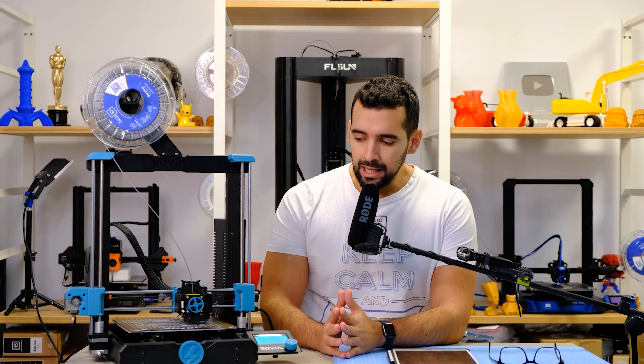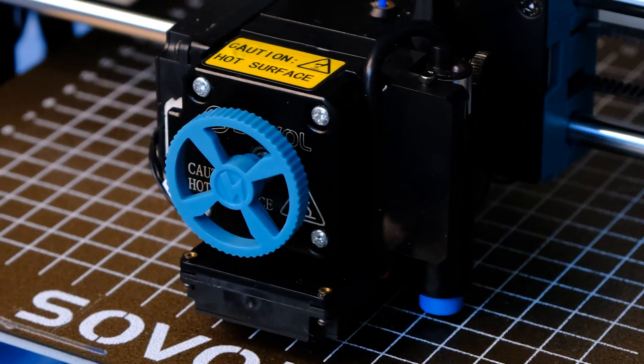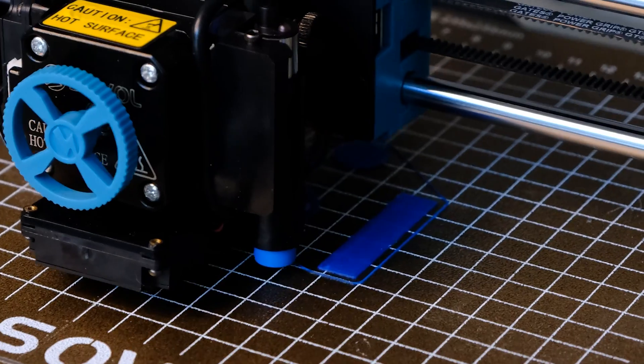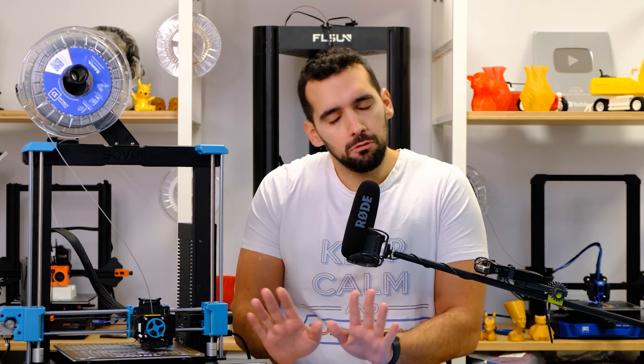This extrusion is very well achieved. To clarify, it is all-metal as standard, which is not normal in a printer at this price, and it behaves very well. It has this front wheel which is very iconic and I like it a lot. It is a very cool take on what the Creality Sprite extrusion is. Obviously, here we have a different torque ratio. The layer cooling fan ventilation is super horizontal — practically parallel to the heated bed — but it has defended itself quite well despite that peculiar position.